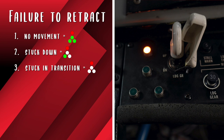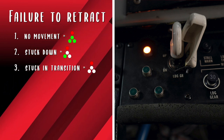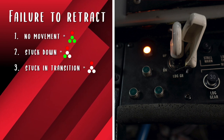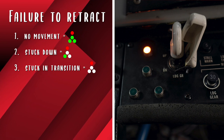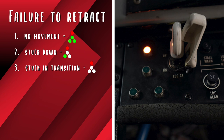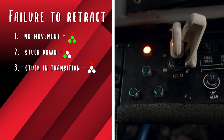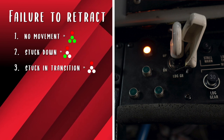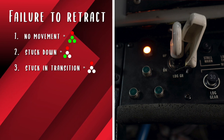Third, all three green lights go out but the red light stays on. This tells the pilot that one or more of the landing gear did not make it all the way up, or there is a short in the wire to the disagree light. Verify using sound, feel, and outside resources as available. Then return the gear to the down position if able. If unable to get the gear down, a partial extension landing may be required. Exercise extreme caution.